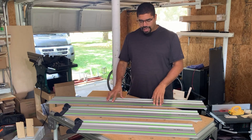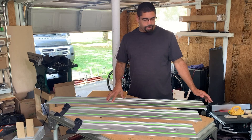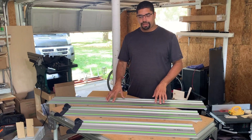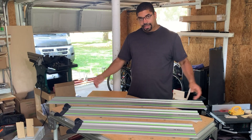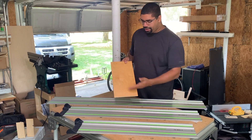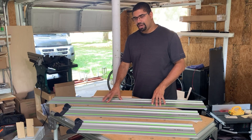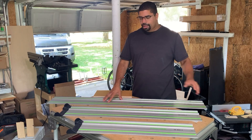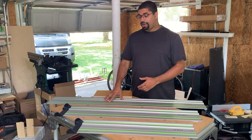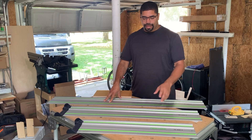If I could only have two tracks, I would do the 800 millimeter and then the 75-inch equivalent — which is about a foot longer than this rail. When working with sheet goods I'll be doing some long cuts, cutting across or along the sheet, and the 1400 isn't quite good enough for the full 4x8 cross, which is why I use that extra-long track. The 75-inch and the 800 millimeter will serve most needs best.